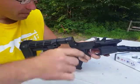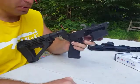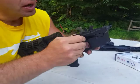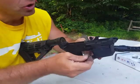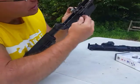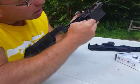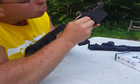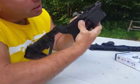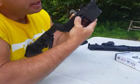So now that I've got this Allen key in there as a placeholder, I'm going to take this pin and push it through. As I pull out my Allen key, I'm pushing this pin in. All right, so that's the secret to this. As you move the Allen key out, you come in with the pin and you just slide them in and out.